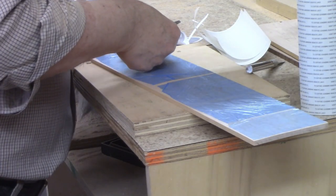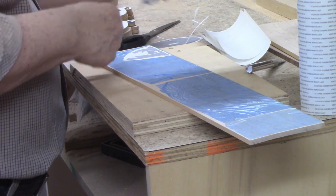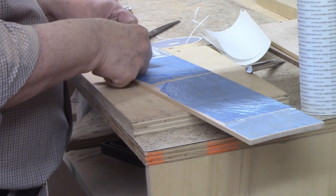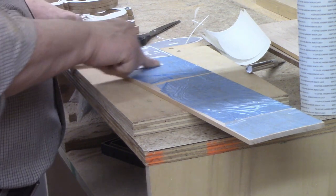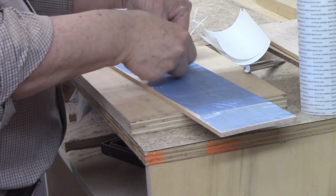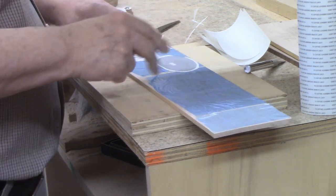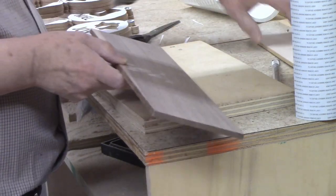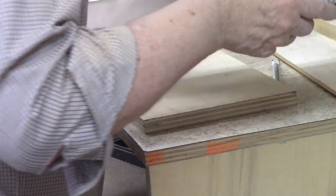I printed and cut out enough patterns to make four mini nativity sets. Mary, the baby Jesus in the manger, and Joseph are all cut as one piece from maple. A sheep and palm tree are together on another piece, and the oval base from a third piece. I arranged the three pieces for one set on the quarter inch maple using scroll saw tape to attach them, so you could see how I lay out patterns to use the minimum possible material. The stable is cut from walnut, which will contrast nicely with the maple figures and base.